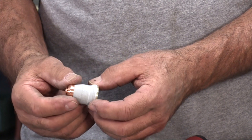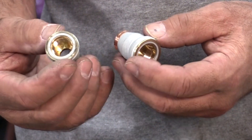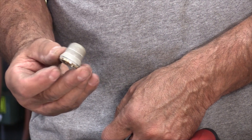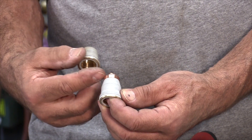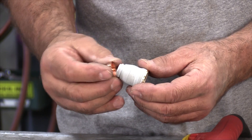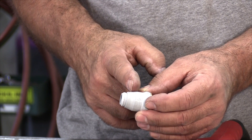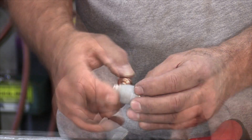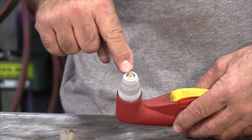This is actually kind of interesting. I never stopped to look at one of these and try to see the difference. This is a regular plasma cutting cap, and this is a shielded cap for gouging. You can see the difference here — this has got this extra little brass piece on the top of it. But what makes it shielded? If you screw that off, you see this is metal, but all down inside here from about this point forward, this is all Bakelite or plastic — whatever kind of non-conductive material it is. So you've got it on the gun and your nozzle is sticking up in there, actually in this non-conductive part of the cap.